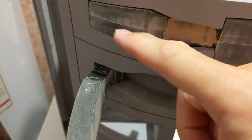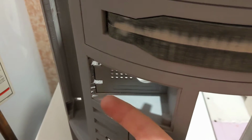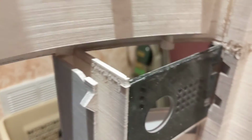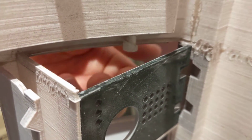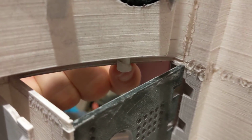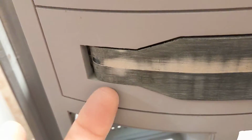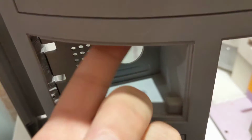Now, bottom utility arm. How's that one held in place? Well, it's not from the top down. It's from the bottom up. There's a hole right down here. If you have that top panel on, you can't get to that hole to put this pin in. So you can see right here, this is the pin printed in PETG, and it goes up through this hole in this part of the body, which is part of ring 3. Okay, goes up there, and then again comes through a hole in the body into a washer that's inside the arm, through another washer that's in the top of the arm, and then just up into the body about that far to hold it in place. Well, yeah, first I had the lid on there.